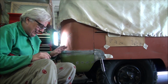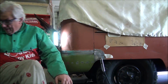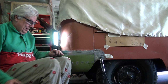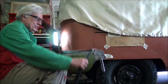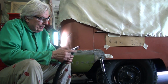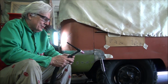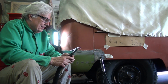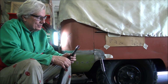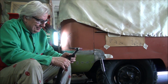I've got a feeling when I get over here I might have to switch over to MIG because the gaps might be too large. I've changed my torch setup. I've taken the 26 off and I've put the 17 on. I put a gas lens in it with the number 8 cup. I've never used a gas lens before today. And anyway, I've got it set up. I've got a 1.6 tungsten in it, blue tip. I can't remember what that is right off the top. I think it's lanthanated.